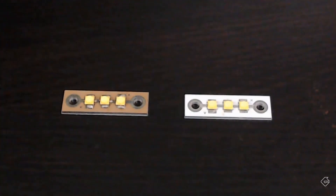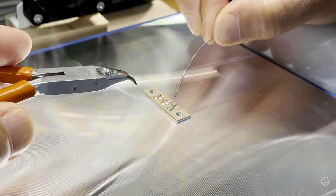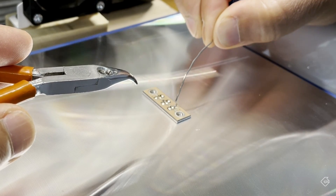Nonetheless, it worked. I was able to melt the solder, attach my PCBs — but take a look at this lovely little brown shade I have on my printed circuit board. The other thing I didn't like is the blobs of solder that were showing up. I wonder if that's because the flux was evaporating. Inside most solder there's usually a small amount of flux — this one says 2% — and flux is a chemical that makes soldering easier. It's supposed to wet the surface so the solder doesn't bubble up, but it can evaporate a little bit too fast, and I think that's what was happening because I was cooking this at 375 degrees Celsius.